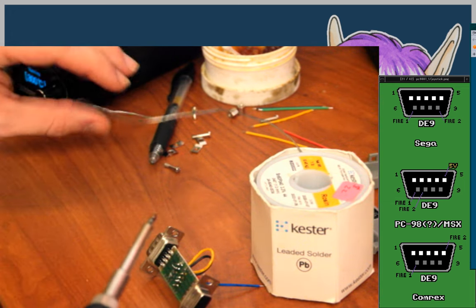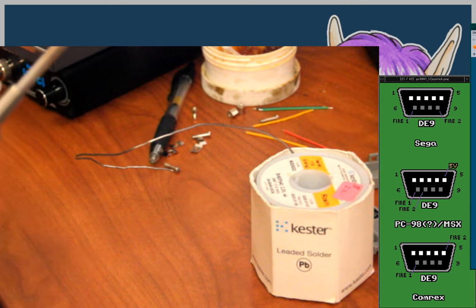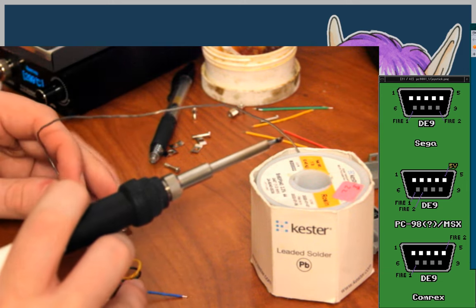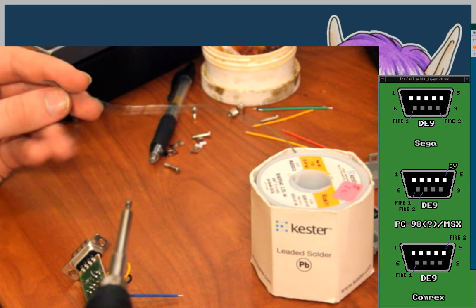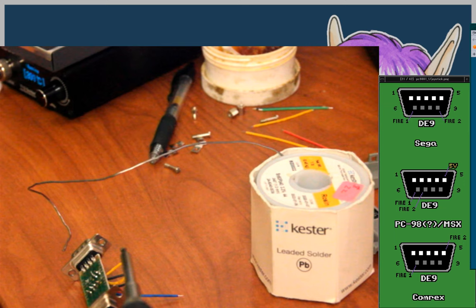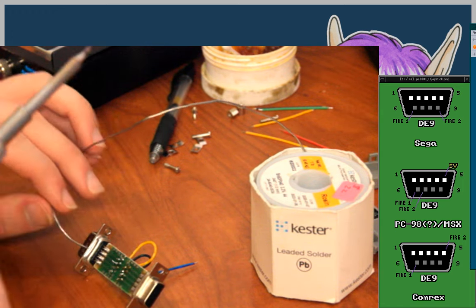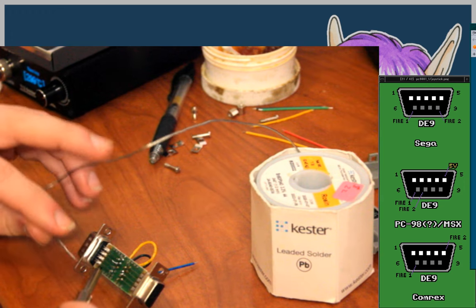This also wouldn't be a terrible first soldering project, as long as you're okay with it not maybe working out well in the end, and as long as you could keep the wiring straight in your head. But the pitch of the pins is good enough for, I think, something close to beginner soldering. A perf board is the other great way. Not like the solderless breadboard, but like the perforated board that just has a whole bunch of holes in it. And get the kind that has metal pads, like copper pads, around each of the holes. Doesn't have to be copper, but some kind of metal, so that you can solder to it. The ones without the metal plating, you can still do projects on them, just you won't be getting the full experience of identifying cold joints and stuff. That's much easier to do on a PCB, in my opinion.